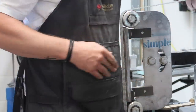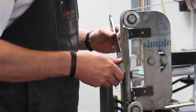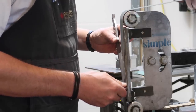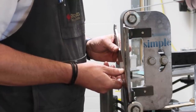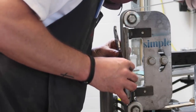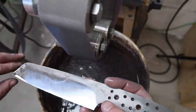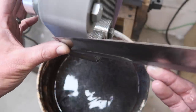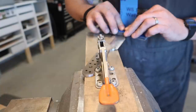Now that we've got those dealt with, we're going to do the finished grinds on our bevels. We'll continue with our flat grind — I think I went to about 20 thousandths of an inch as a flat before I switched over to the rotary platen. A lot of people keep asking if I still like the rotary platen — I've only had it about four months but I absolutely love it. It's a very forgiving grind, and as long as my grind lines are really close with the flat grind, I can jump onto the rotary platen and it's just beautiful. Now I'm going over with a super fine belt, really refining those scratches before we jump to the dreaded hand sand. We'll hand sand this thing up, get all those transitions and plunge lines cleaned up nicely, and pretty much get ready to do the rock patterning.